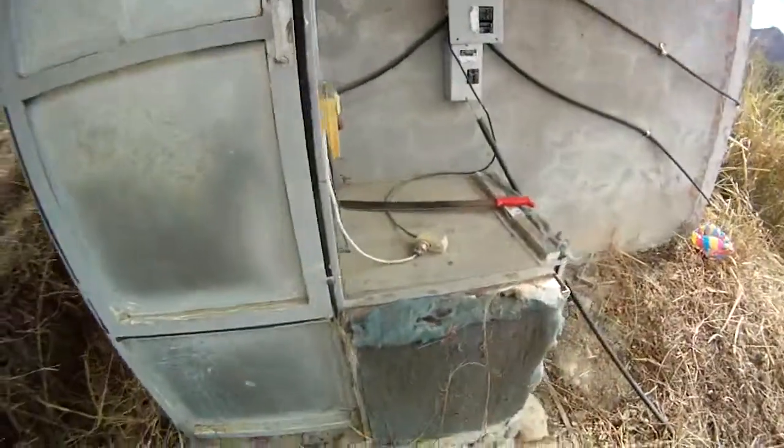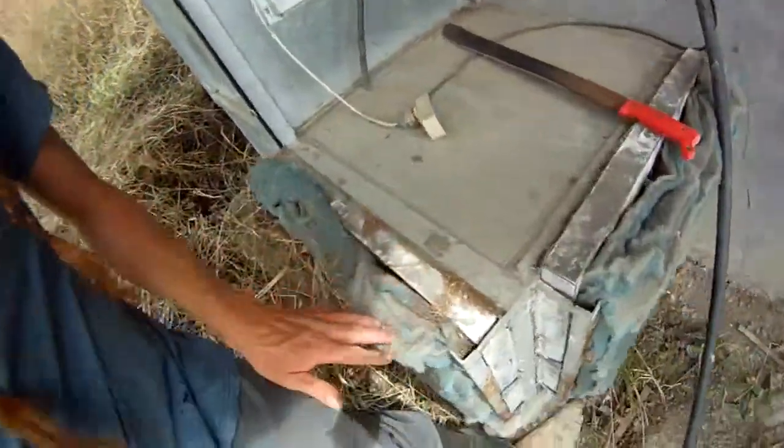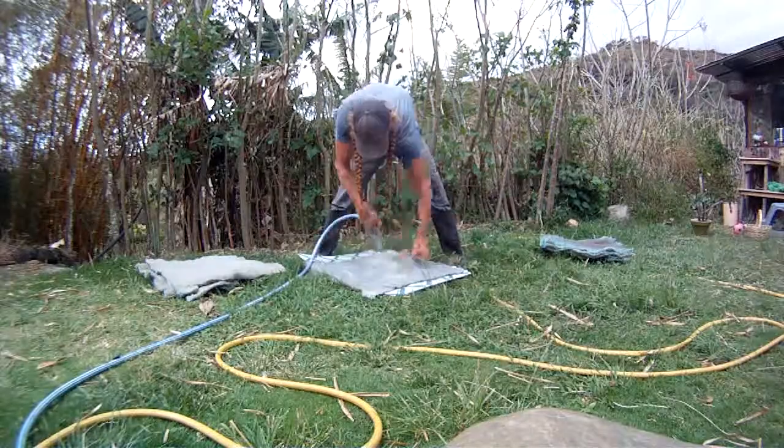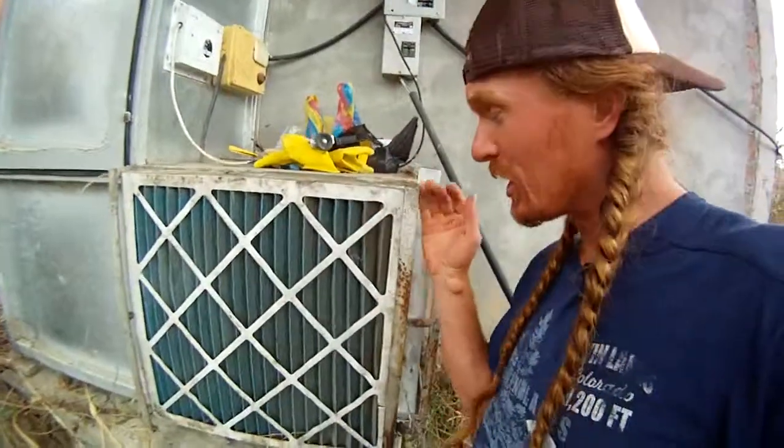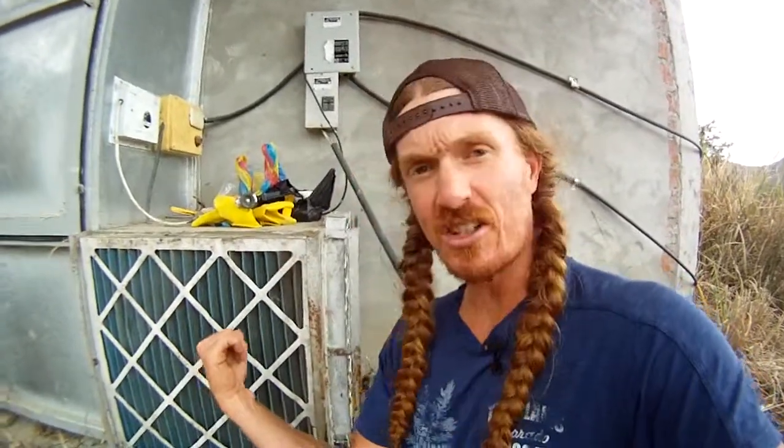First things first, I've got these dusty, dusty pre-filters behind them on my second pre-filter, so I'm going to take those off and clean them. I pulled those pre-filters off yesterday, cleaned them up real nice. They're over there drying — soaked a lot of dust out of there. Basically it's like four little fuzzy filter pads that pull out a lot of the dust to add longevity to this filter. It's a bunch of series of filters adding longevity through all your filter stages, the last one being a HEPA filter. Mine is a 12-inch thick HEPA filter — those are somewhat spendy, and I'd like it to last as long as possible. So all your pre-filters are protecting that, as well as protecting the squirrel cage blower that provides the airflow.